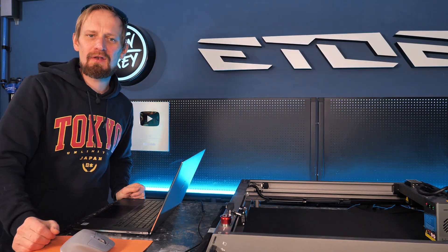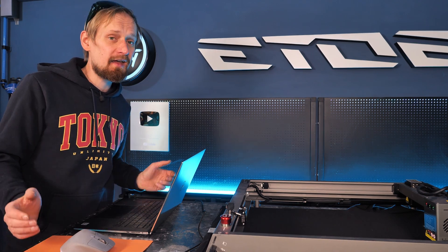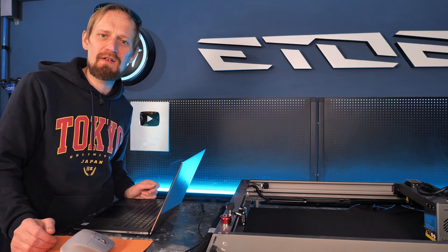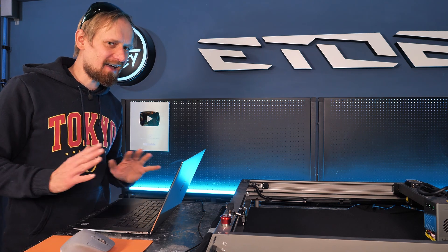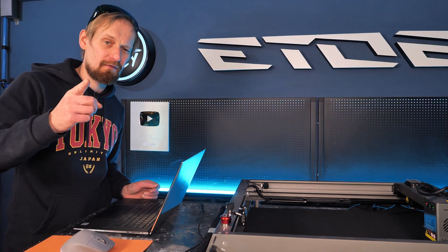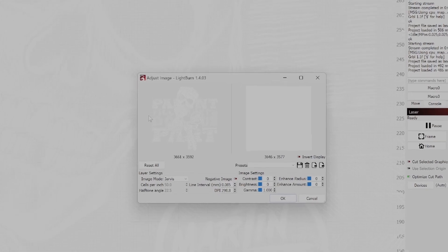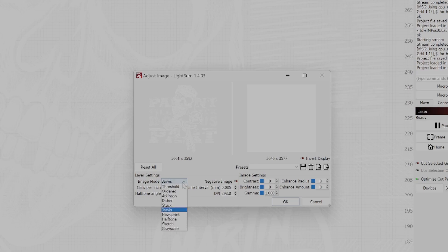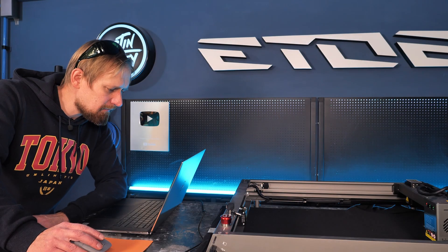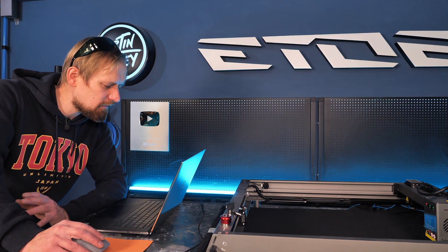Let's do a quick LightBurn crash course before we do the engraving. There are two important facts: first, I want to engrave only the white areas from my Photoshop graphic; second, I have to convert them into a bitmap and from white to black, because the laser understands only black — it can't engrave white areas. LightBurn is the software that handles all of this and controls the laser. There's a free trial available — I'll link it in the description. I hit File, import all the white areas from my Photoshop graphic, then right-click the graphic and hit Adjust Image. Make sure image mode is set to Jarvis — this converts any JPEG or Photoshop picture into a bitmap of pixels. The only thing you need to know is that image mode is on Jarvis.